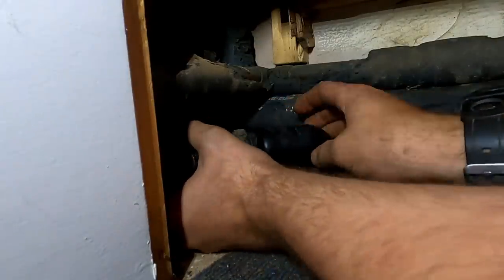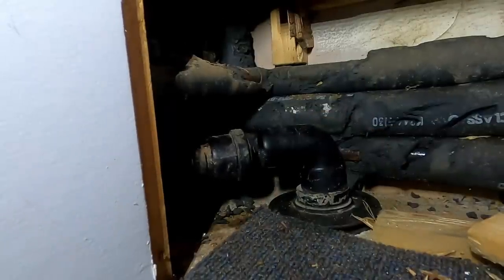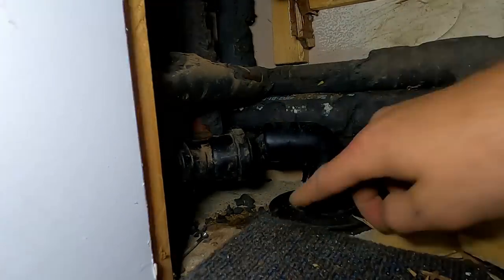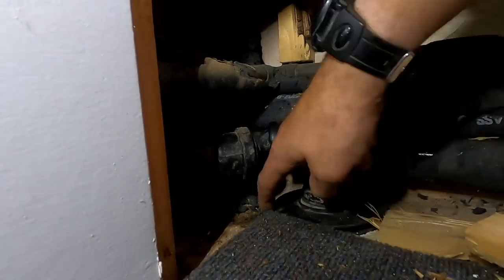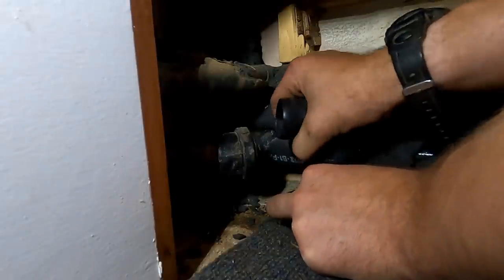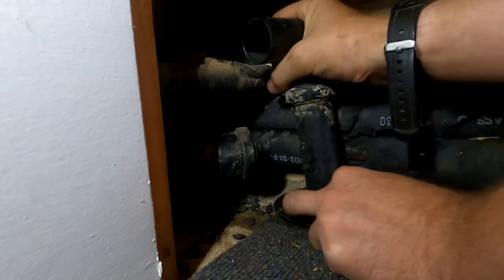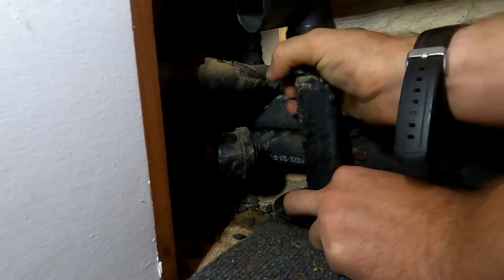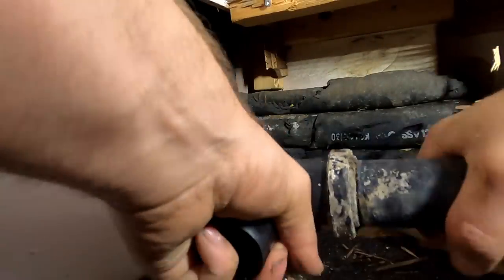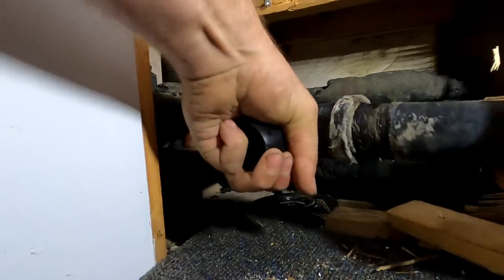If anything that wants a 90 and a bit of pipe — I'll see if I've got some. It's just going to be short. That bung is definitely in though; you can see the seal has gone all the way around, so you'll get a good seal on that drain. I don't actually carry... worst case scenario is the bit of pipe that goes in — it doesn't need to go that far through, so if I've just got a push-fit 90 I can use some of that pipe. I'm going to do something a little bit naughty but I haven't got any push-fit waste pipe in the van.